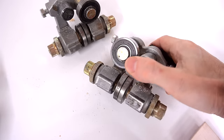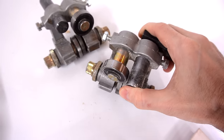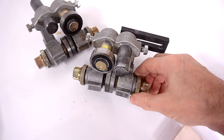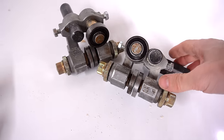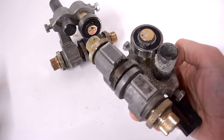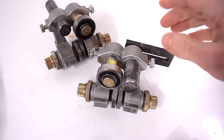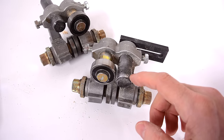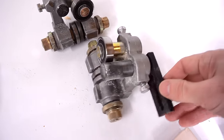The clear losers in this test were these blade guides. They were sent to me by a friend, Ted, who replaced the blade guides on his bandsaw with Carter blade guides. So he didn't need them anymore, and I thought I'd have a use for them to replace the blade guides on a bandsaw in my dad's shop, but I never got around to that. Really, these ones are meant for much wider blades. But I was running all my tests with a quarter-inch blade, because the narrower the blade is, the more the blade guides matter. If it's a wide blade, it's much easier to guide the blade.